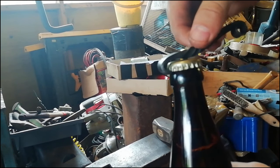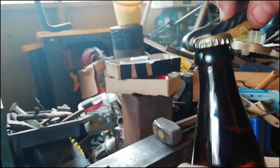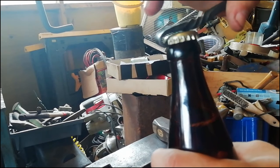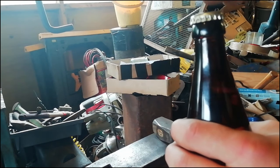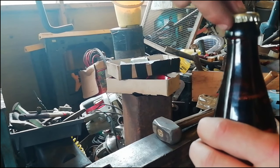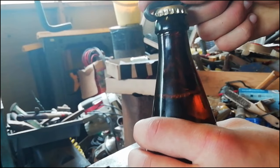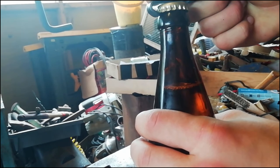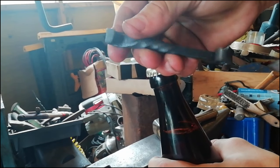And it's quite nice, because if you can see, this tail butt flicks up a little bit. And that's really what you want, because you get that more leverage. If it's just flat on the whole thing, then you won't really get as much leverage. But because there's a point pushing down, it's more likely to just peel off. That's good. Yeah, I could hear a little bit of hissing. So that's good. We have made a functional bottle opener.